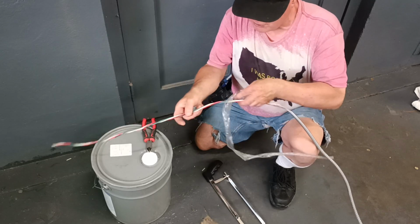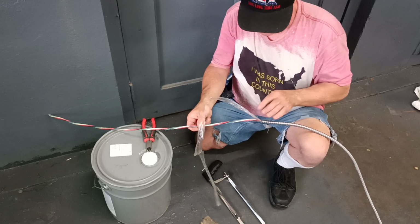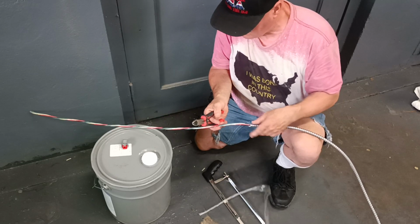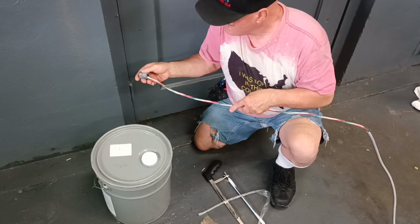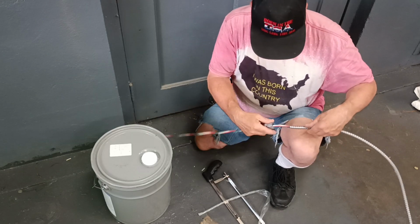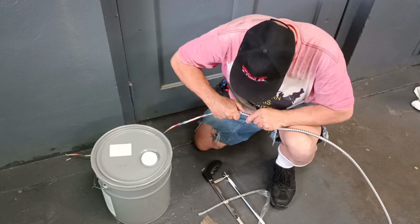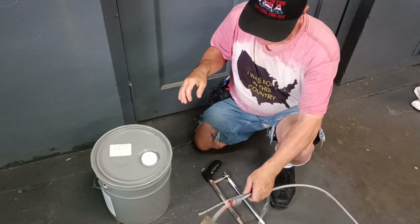Here in the country I was born in, for commercial wiring, we use 12 American wire gauge on 20 amps. For branch circuits, for lights and outlets, black is live, red is live, and blue is live, and the green wire is the ground. So we'll stick our wires into our bushing here, the clamp. And you'll hear the little barbs snap inside, so just push it. You can hear them snap inside there. So now we're ready to install this into the box.